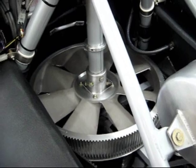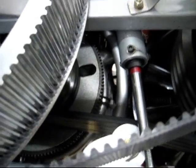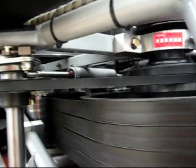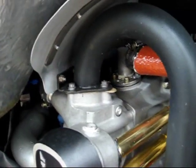There are other products out there you can choose from, but a little word of advice — you better be careful with what you buy. Another thing we do is check for belt tensioning. I use an electric clutch on this helicopter. The drive system does come with a hydraulic clutch, which I'd recommend purchasing with the unit. We're also checking belt tensions on the drive belts and belt tensions for all the other components in use. Looking at the fan and radiator, you're checking for any sort of leaks, making sure all components are tight, and torquing all bolts at the required times.